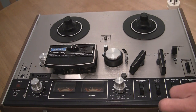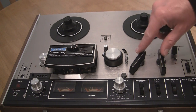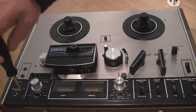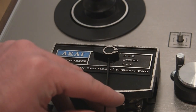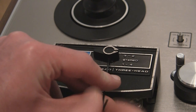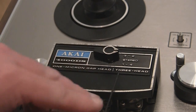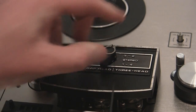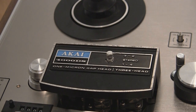And basically that's us done with those — apart from one hidden one. We just need the allen key to take the other bits off, such as the forward and reverse levers and the head cover. I'll get my allen key and make a start on that. Place the small allen key in the head cover and take it out, being very careful not to scratch anything below where the writing is underneath. Just take that out as far as needed and eventually it will pop off.